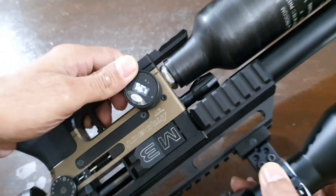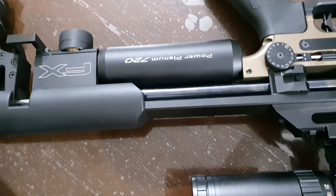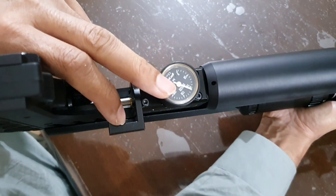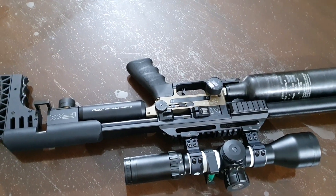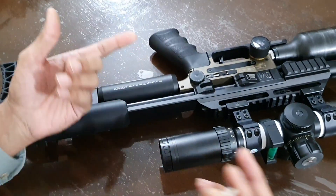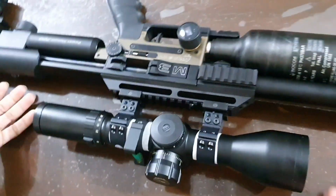So this is one more upgrade I have done to this gun. My plan for the future: since I don't shoot slugs and shoot pellets, my second regulator is set to around 110 bar. I want to try installing the PEEK piston in the second regulator as well and then share the results with you.